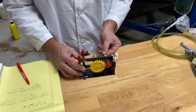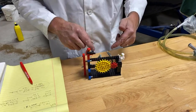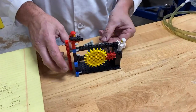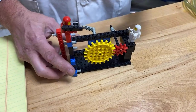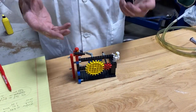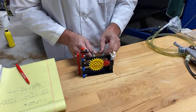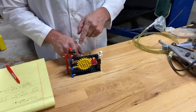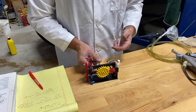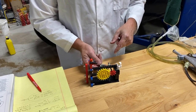But this also means we're multiplying or dividing force. With three pounds of force on the big gear, we're going to get seven pounds of force on the other one. I'll apologize to all physicists and engineers — I'm playing a little loose with terms like 'pounds of force,' but my goal is to get the concepts in place. Basically, you're trading speed or distance for power or force. This is how your transmission works, and it's a direct analog of how hydraulics work.